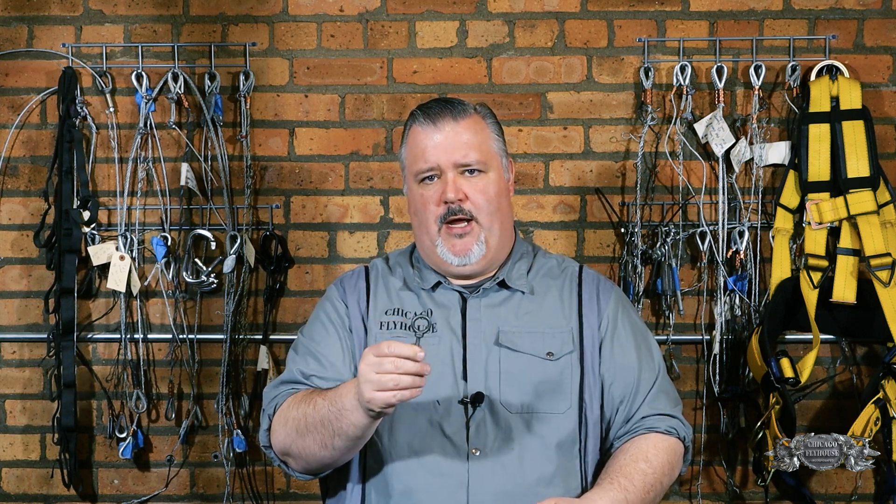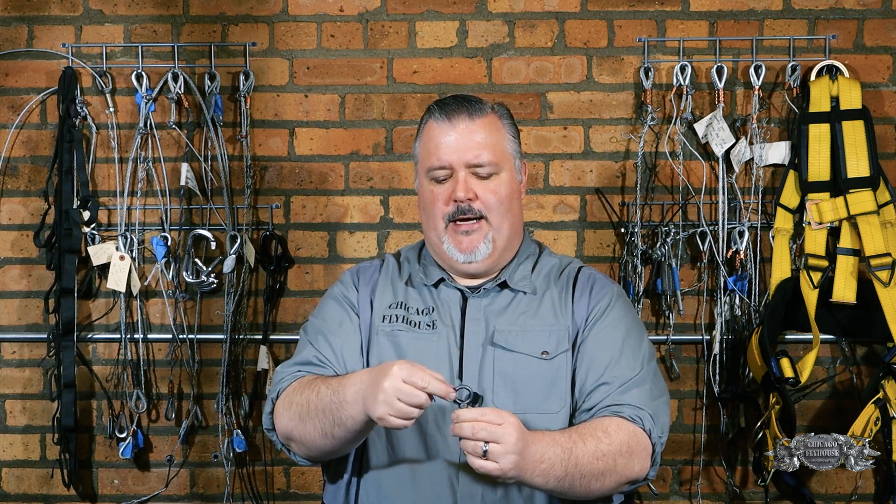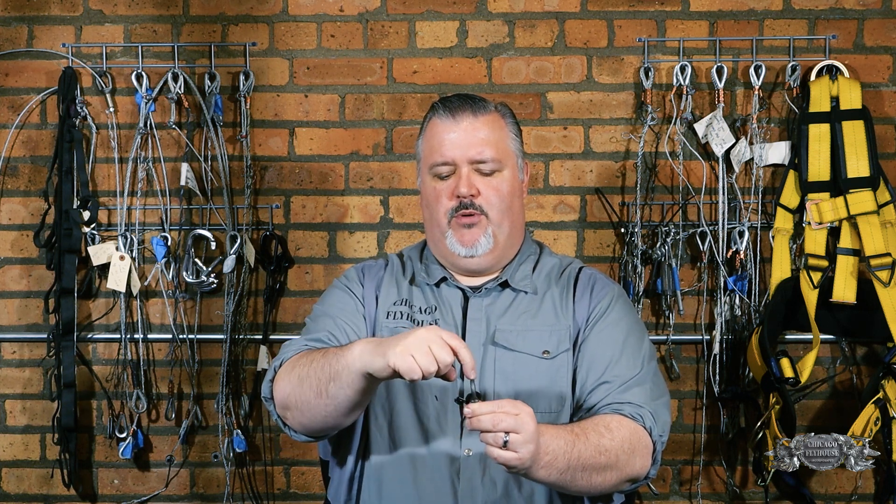So what's the takeaway from all of this? There are a couple we want to suggest. First of all, when it comes to using bent wire eyes, it's just not a good idea. They're generally not predictably strong enough for the things we want to do, and in our business we want to know what the strength is going to be — these are just no good. We want to go with forged, shouldered eye bolts if we can. But there are a couple things we've got to pay attention to: we have to pay attention to the angle that we're loading the eye bolt at. We want to load it in line with the shoulder and the ring of the eye bolt. We don't want to pull sideways — it's not rated for that.